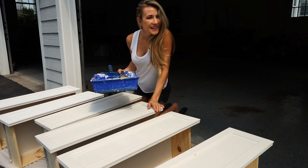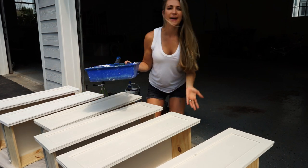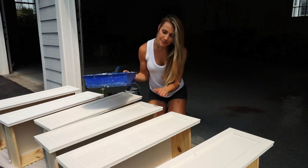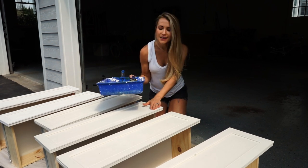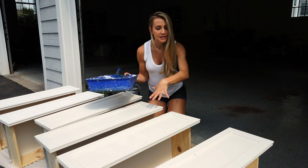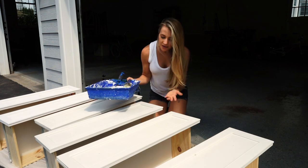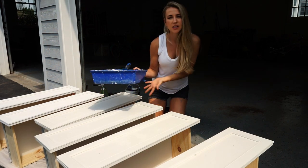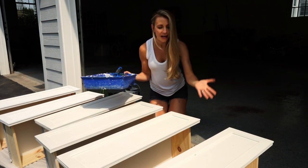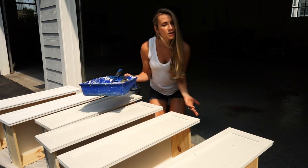A few of these done and they've been drying, I thought, why are they so flat? Why is the finish so flat? And it's because it is. I definitely asked for satin finish in this paint. Check the tin. It's actually eggshell, which is not the end of the world. It's just for things like cabinetry, closets, anything like that that's more of like a high traffic area, takes a little bit more of a beating. Satin or even semi-gloss finish is just more durable. It's easier to clean.